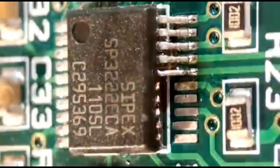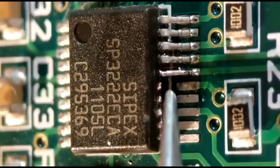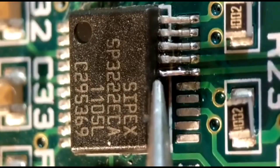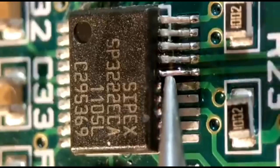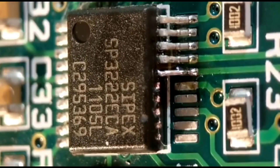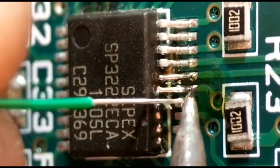I'll clean it properly at the end and put some pictures up. You've got a nice bridge on top and a nice bit down the bottom. I exposed a little bit more copper before doing this by gently breaking some of the IC body off with a scalpel blade — the main IC components are right in the middle so you can get away with that. Literally just repeat that for all three of the first three, then I'll do the other three with a different method.